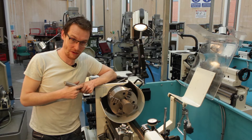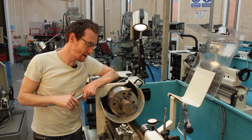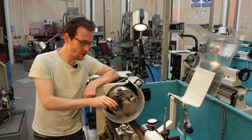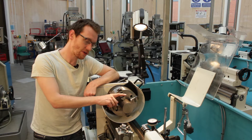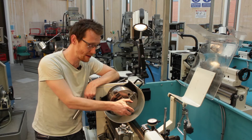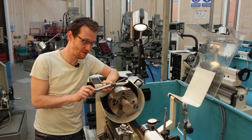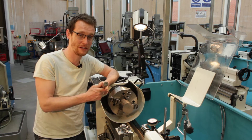Hello, 5 Minute Friday number 11. Today we're going to compare various types of work holding systems on the lathe. Last week we put a piece of stock into the four-jaw, trued it up, and noticed about two hundredths of a millimetre runout — probably due to surface finish and the fact that the stock isn't perfectly round. So for a true test we're going to use this ground mandrel. It has been shop-soiled and has a few surface finish defects, so don't feel bad about gripping it in a chuck.